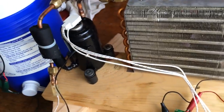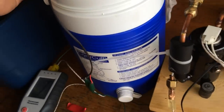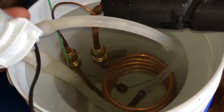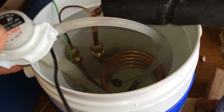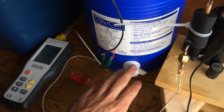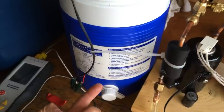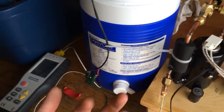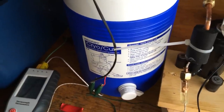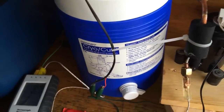It saves me a lot of time and I enjoy it. So I'm set up in this little ice bucket here — picked that up at Goodwill for a couple of bucks, pretty happy with that purchase. Eventually what this bucket is going to be — that coil is actually going to be raised a bit in the water. In this drain here, it's actually going to be two copper lines that form a two-phase thermosyphon. The condenser of the thermosyphon will enter in there and be coiled at the bottom, where vapor can passively condense and drain back to an evaporator at the bottom — somewhat similar to a heat pipe operation, and somewhat similar to a single-phase water thermosyphon loop for a solar heat application.